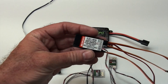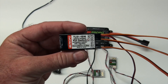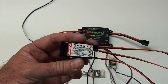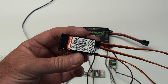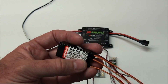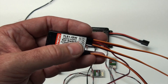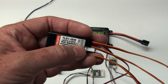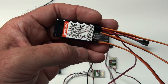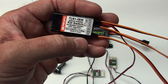This is an item that's been around forever but I'm really excited about it because I haven't got to use one. It's an ignition optical kill switch. The difference between this and some of the bazillion other ones out there is these work. It's got a case around it — it's not just a circuit board bouncing around inside your airplane. They actually put a nice case on it. It goes up to 12.6 volts. It has two ignition outputs, so if you're running a twin ignition like a DA200, you can run both ignitions with their own power line. It has an RPM sensor where you can see it on your radio.